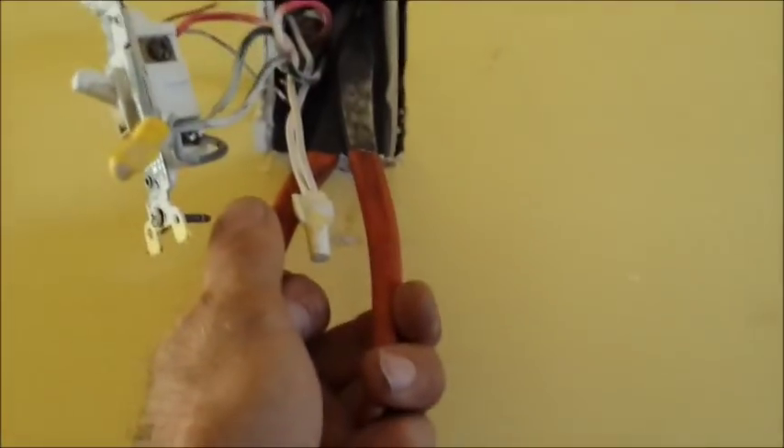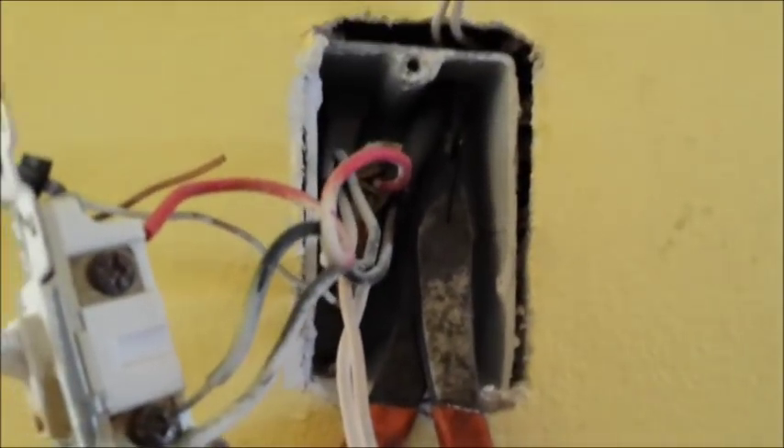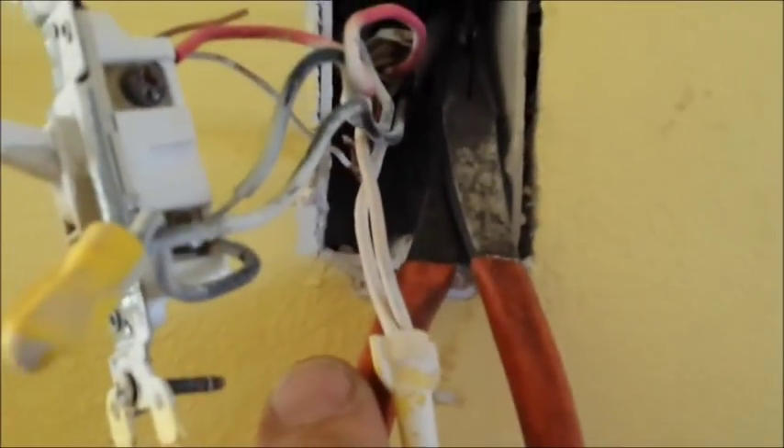Now one more thing about wire selection — you need to match the gauge of wire that this circuit is using. This particular circuit is a 15 amp circuit right now, which uses 14 gauge copper wire. Now if you're using aluminum wire, it may be 12 gauge on a 15 amp circuit — a little thicker. Wire materials can vary on the thickness in relation to what amperage of breaker. In this case we've got copper wire, it's 14 gauge wire on a 15 amp circuit, which is the way it should be. So we are going to add a 14 gauge wire — we pulled the fish tape through and I've taped on my 14-3 copper cable.